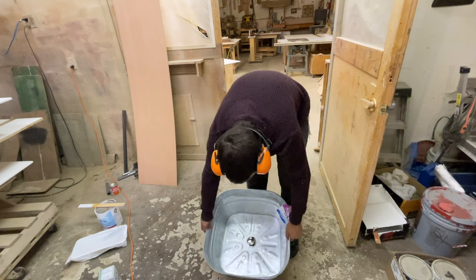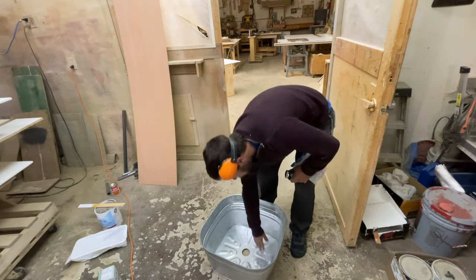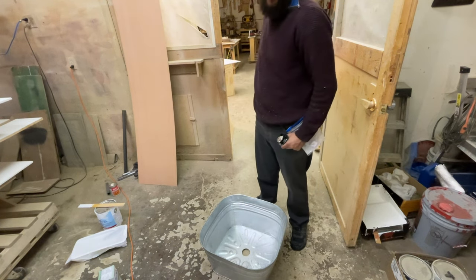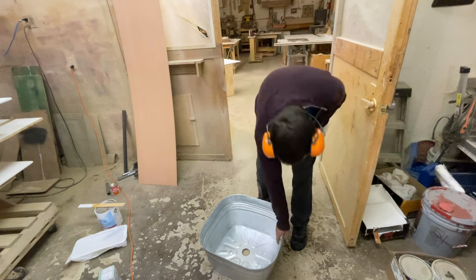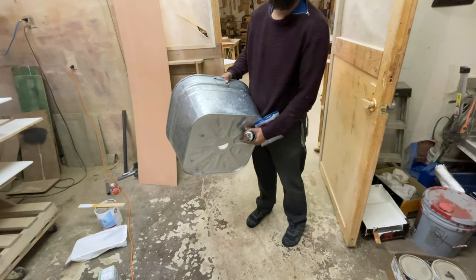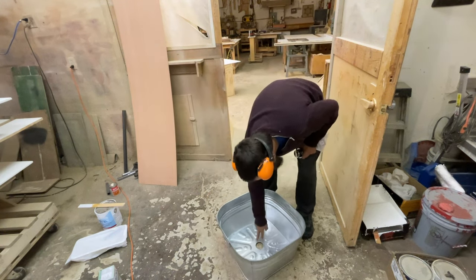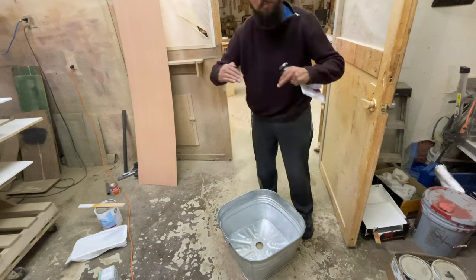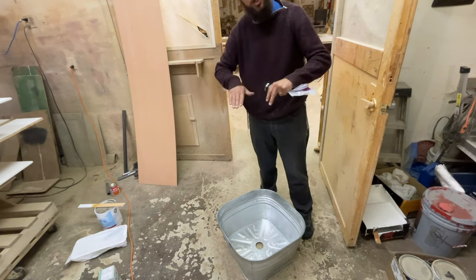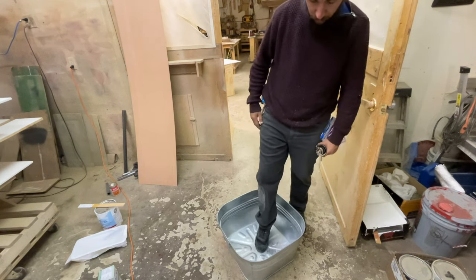That'll fit nicely. The tub itself has a little give, so it'll support that with maybe a 1/2 inch plywood. So we'll take a scrap piece of plywood, fit it to that measurement, glue it to the underside so it's not gonna move as much. But we still want the water to flow to the middle, so I might need to bevel that plywood a bit. And that's just to shave around the circle so it slopes towards the drain.